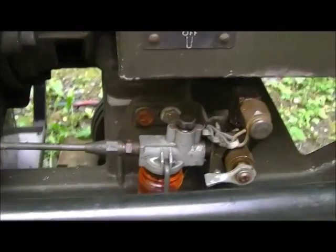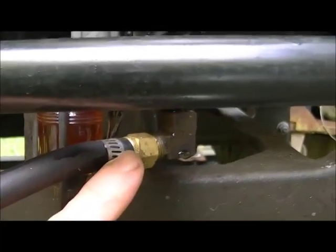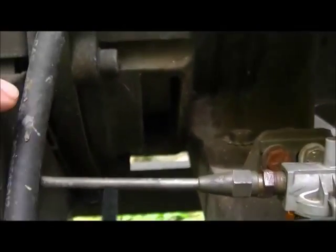With the fuel tank above the engine, the fuel pressure comes down through this hose into the same valve as before. We're hooked up right here — you've got your sediment bowl for water separation, and then the output pipe goes back up to the fuel pump.